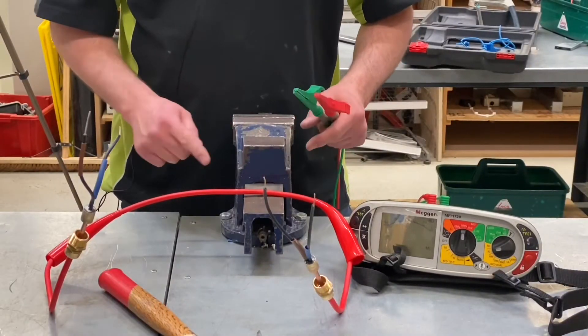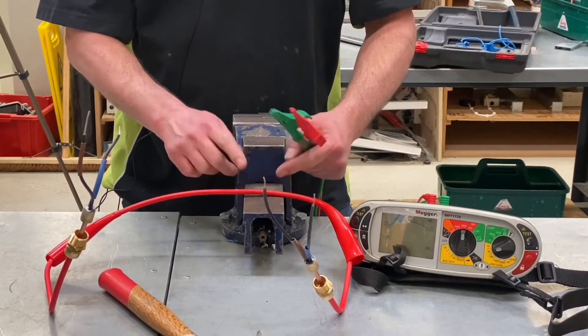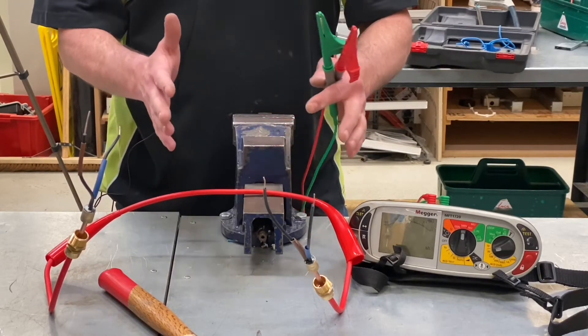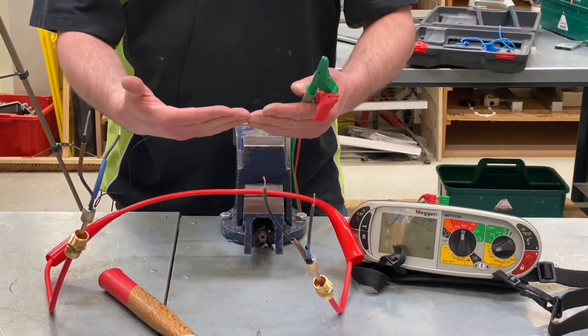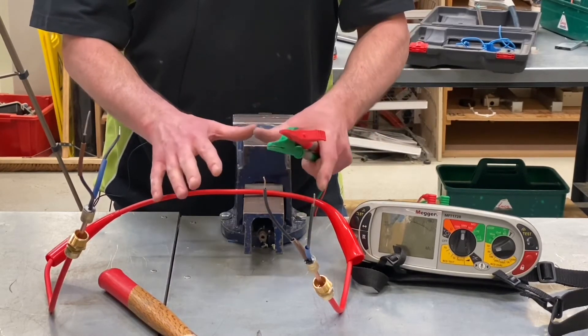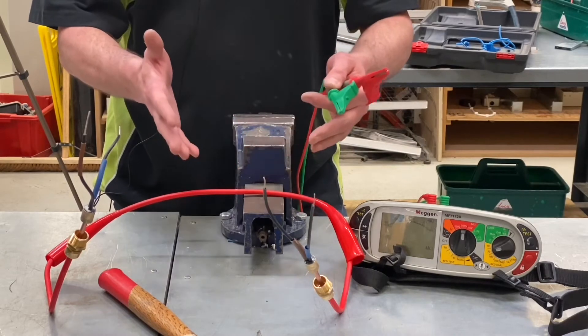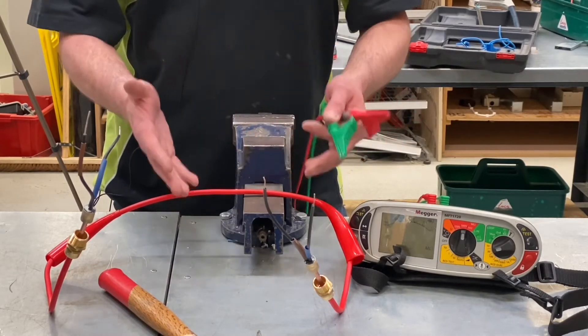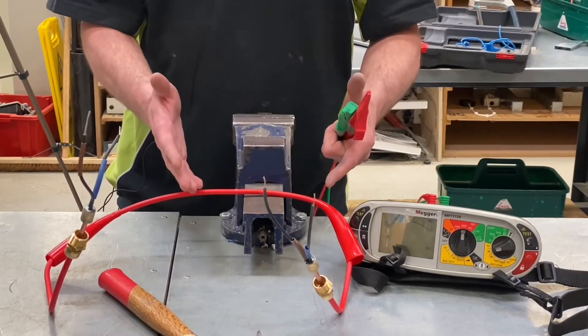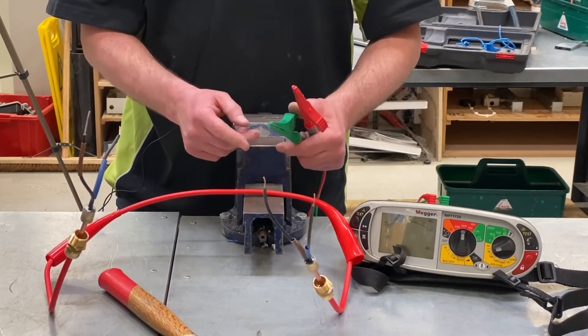We're now in the electrical workshop and we're going to give this a good whack. We know it's fire resistive, and we know it needs to be held using metallic fixings — from our classroom discussions — because when it gets red hot we don't want it to move, as it could shatter. That's why we use metallic fixings on fire resistive cables. It happens to coincide with the rules for premature collapsing, but that's by default. I want to show how mechanically robust it is by actually giving it a whack with a hammer.